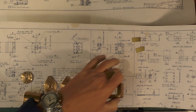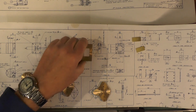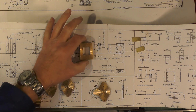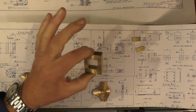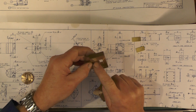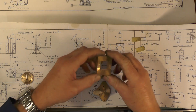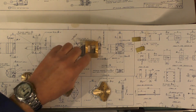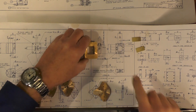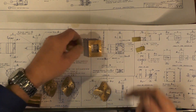I think I'm ready for doing this valve chest now. I've got to bring it to size on this dimension across here - this one's okay. The hole in the centre just wants trimming up a fraction, and then I'll get it marked out for the fixing holes, and then we can have a look at all these holes that go into the ends and the sides.